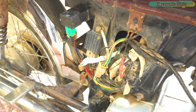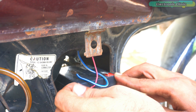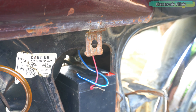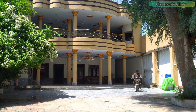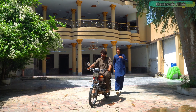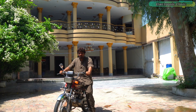But let's imagine they open the casing. You might be wondering what they do with the security system. Well, the thief disconnects the battery wires, which makes the security system useless. This is the case when a cheap anti-theft system is installed. So to start the bike, the thief or another person will have to quickly push the bike — similar to what we do when the battery is damaged or completely discharged.